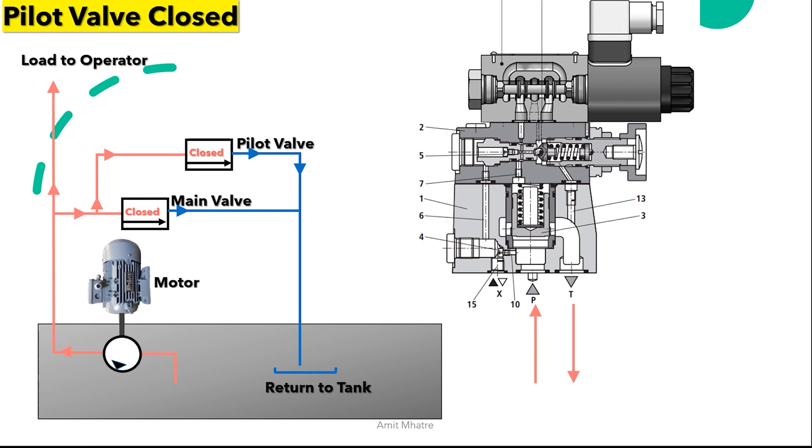The motor will pump the flow with high pressure and the DBW valve will restrict the return flow to tank. As you can see in the drawing, the flow of oil through the pilot line will act as counter pressure on the main spool. Oil will not flow through the bi-directional solenoid or spring operated pilot valve.